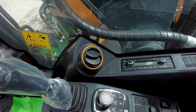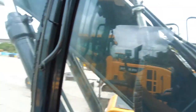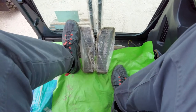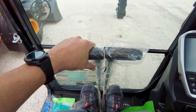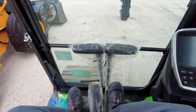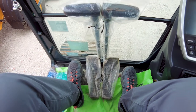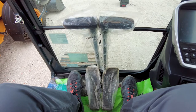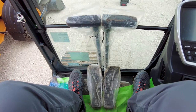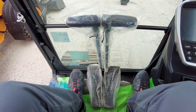What I'd like to do first is just show you a little bit about the cab. The cab is basically the same as what was on the previous series, but they have made a few improvements here and there. One nice thing about the Hyundai cab is they have very large foot pedals for traveling forward and aft. You've also got hand controls to do the travel as well. There are two foot rests on either side of the travel pedals. One nice thing that Hyundai has done is they've come out with a straight line travel feature. Many competitors will offer a dedicated travel pedal, which was usually located on the right-hand side, and that controls the forward and aft of the travel function with one single pedal.